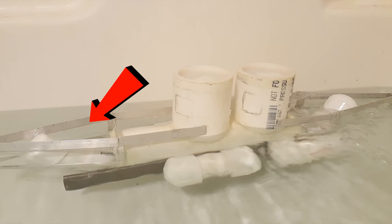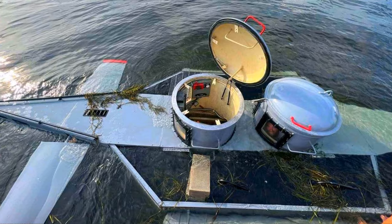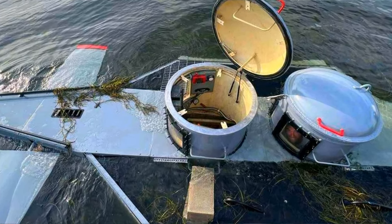We have a front ballast tank, the aft ballast tank, and two ballast tanks on each side. Those four in the middle are the main ballast tanks. As you can see from the scale model, the real submarine sits pretty close to what that scale model did in the water. The scale model also allowed me to figure out how it was going to stay trimmed on the water and below the water, because as the submarine goes under the surface, its dynamics are going to change as far as its trim.